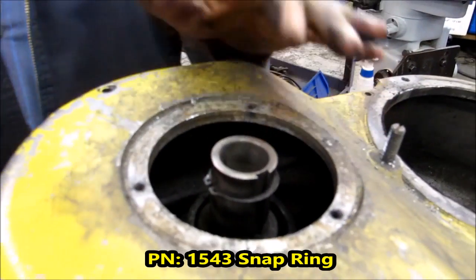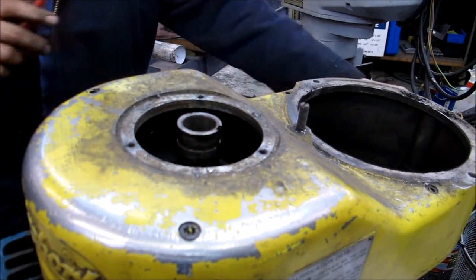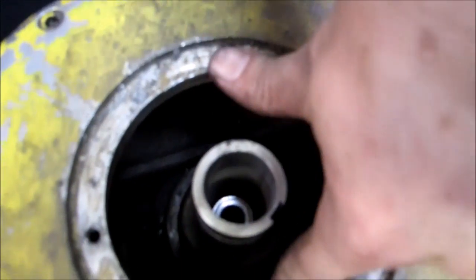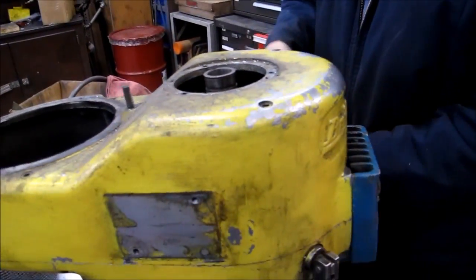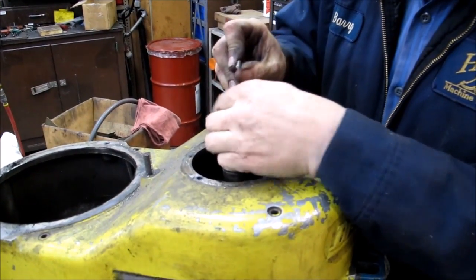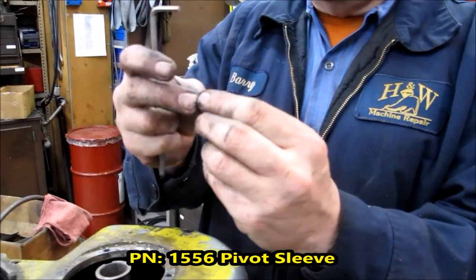Our next step: there's a snap ring right on the top of the front spindle pulley hub — take it off. Down inside there, on most of them there are two socket head cap screws holding the tilt plate on. This one is very old, there's only one. They're sometimes in very tight, so a lot of times you'll need to use a wrench to break them free. These cap screws also have a little collar on them — they're what go through the tilt plate.